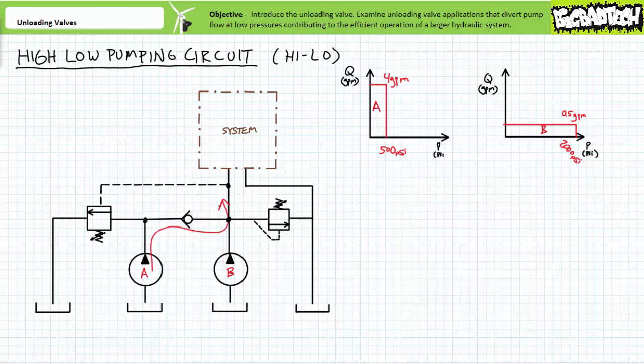That's about it. Other lectures examine the remaining members of the pressure control valve family. In conclusion, this lecture introduced unloading valves and examined their applications: high-low pumping circuits, the differential unloading relief valve used for accumulator circuits, and alternative pump unloading configurations using pressure switches and solenoid-actuated directional control valves to divert flow, vent the main pressure relief valve, or simply turn off the prime mover. Remember to review these concepts, thank you very much for your attention and interest, and we'll see you in the next lecture. Remember to tell your lab partner about this resource and check out the Big Bad Tech channel for additional resources.